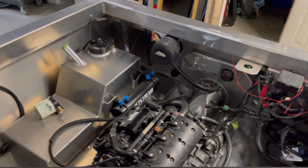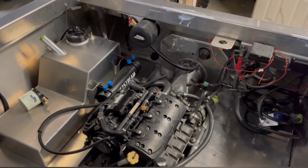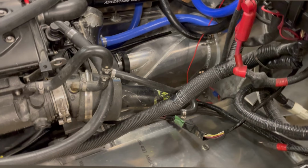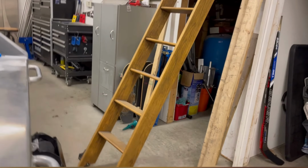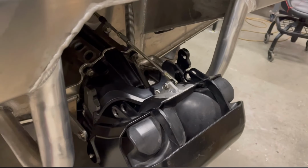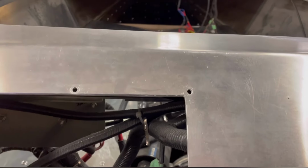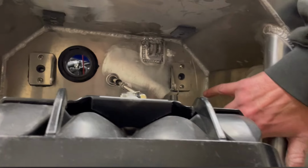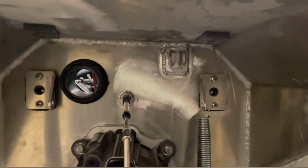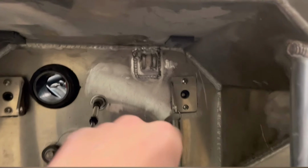But yeah, we learned a lot, but thankfully, now we're at the stage where we can get this sucker plumbed back together. So today: drive shaft in, carbon seal on, jet pump back on, steering, and reverse shifter back on. Bracket for the trim actuator? Oh yeah, that's all welded up and good. So that actuator will go right up top here, and then we'll actually have trim in this boat, which is going to be super nice.